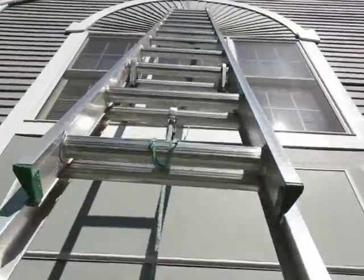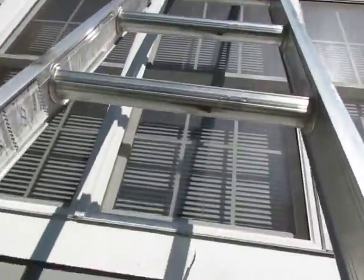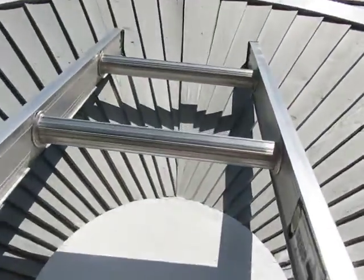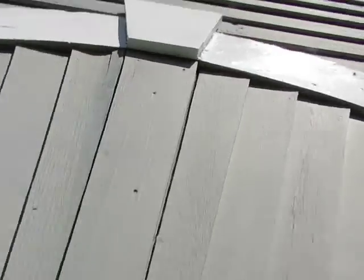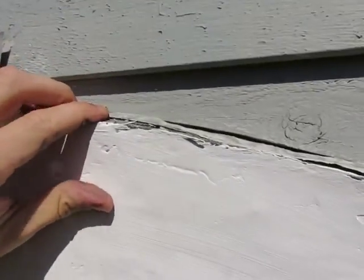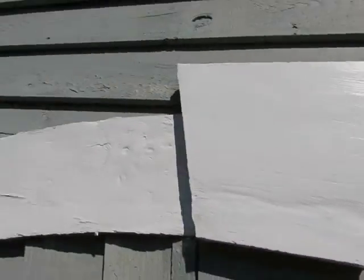On the top, that round arch from the ground might not look like it's rotted. But when you actually climb up here you'll be able to see that this arch — because there's no overhangs on the roof — is all rotted. You can actually feel how soft it is, and you're probably having some plywood rotting behind there.